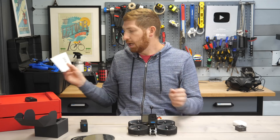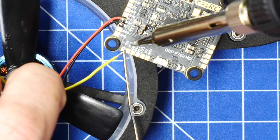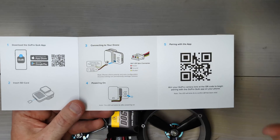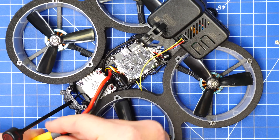First, we need to get this thing wired up. It includes a very brief description in the manual. You're going to connect that pin connector to your flight controller, then reprogram it with something like Betaflight. You have your ground and power being the red and black wires. After that's done, you go ahead and plug your camera in for the first time and hope nothing catches fire — and in my case, it did not, so that was positive.